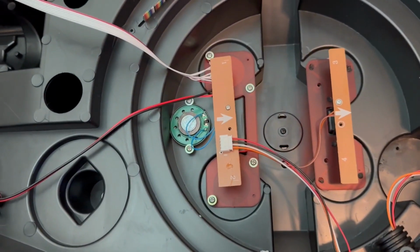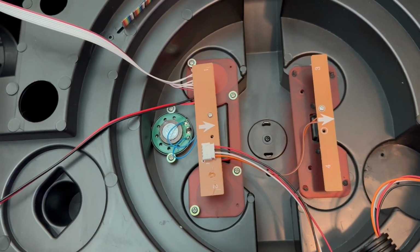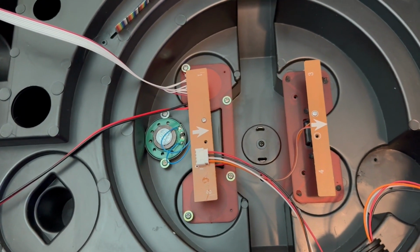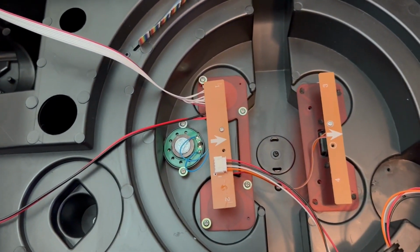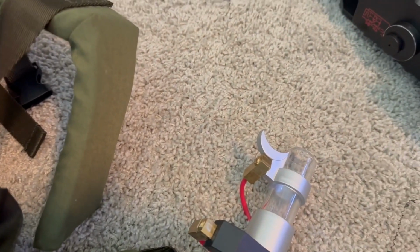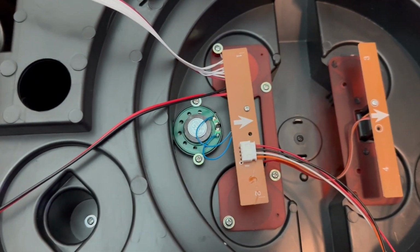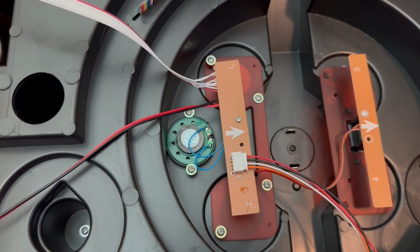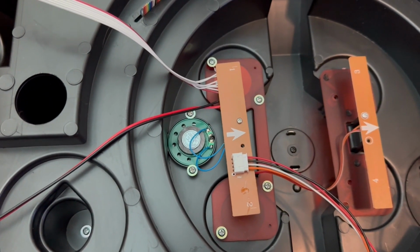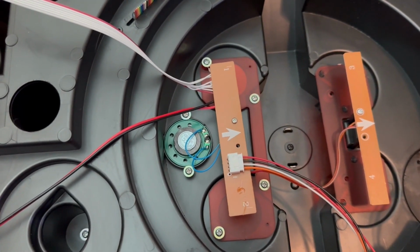Then you've got the other wires, which are the red and orange. If you jump the red to the white wire, that's the slow blow or the trigger. The orange wire would be the LED that lights up in the tip there when you fire. That would be a 5-volt output, along with that ground, that white wire ground. I know they didn't use red for power, and they didn't use black for ground. They just wanted to make things fun and confusing.